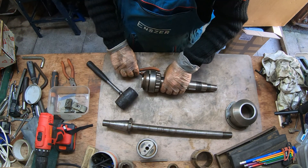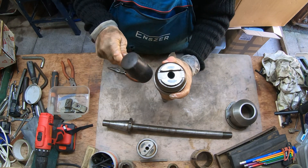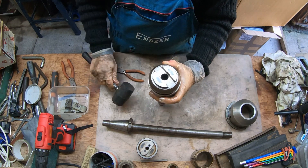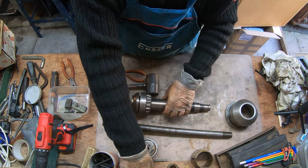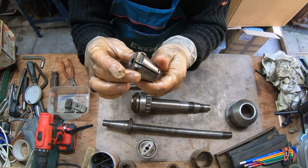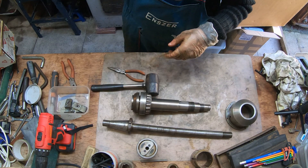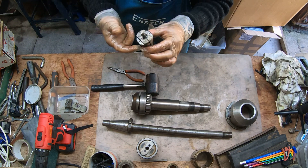I'm trying to keep it simple, I'm trying to keep it as original as possible. But unfortunately this tool holder is obsolete. So I think this is the easiest way to get the machine back into production, and I can do all the tooling once again if I just convert it into the International 40 and buy tools readily available, as opposed to making a new one every time I need to use a different tool in a different diameter.